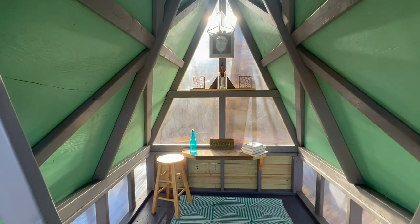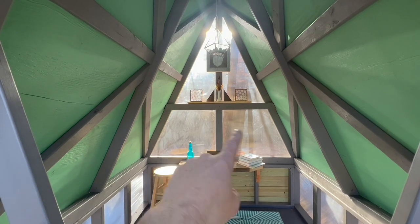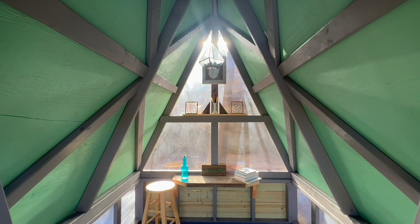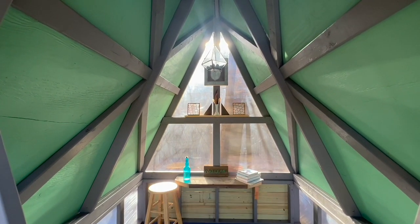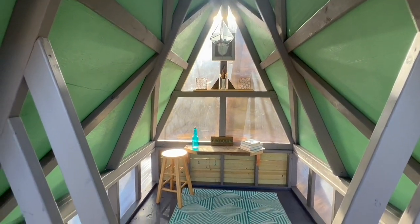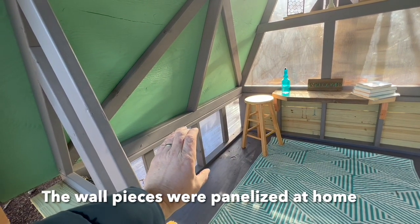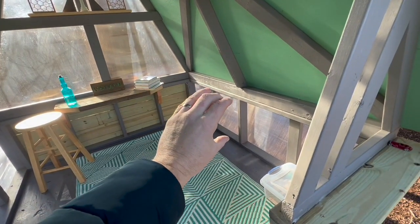Things I reused — first of all, let's start with what I didn't reuse. This is double-wall polycarbonate from Tuftex — the greenhouse stuff. I love it, it's durable, it goes up so well, it gives this diffused light and makes this space seem a bit bigger because you have all that natural light. I do the same thing with these knee walls down below. By lifting up two feet here — here's some tips for A-frame builders, playhouses, tree houses, real houses, whatever — even my plans on relaxshacks.com for the transforming A-frame. By lifting that, you give yourself more side-to-side room and more headroom overall.